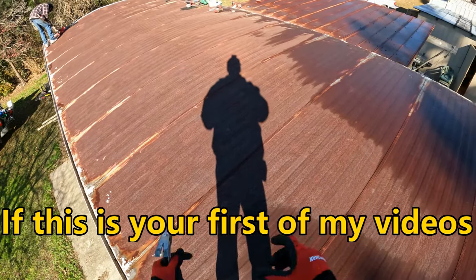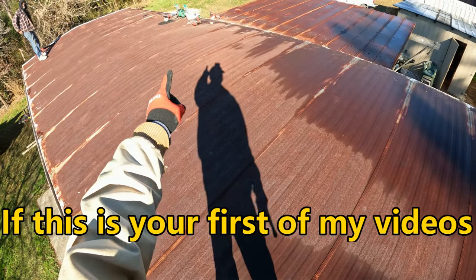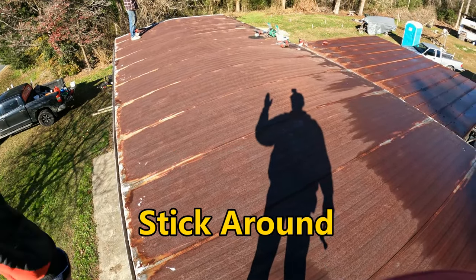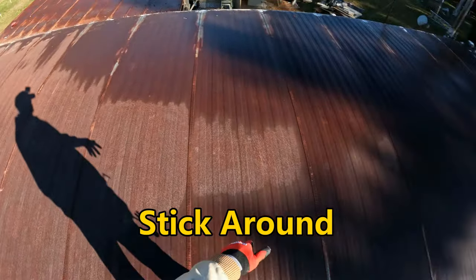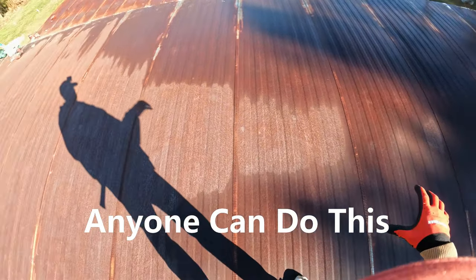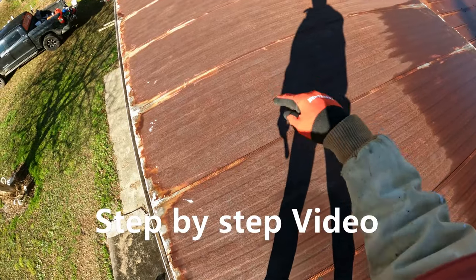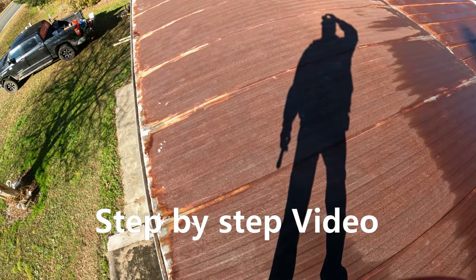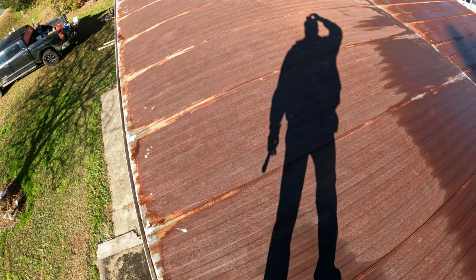We're gonna run slats, 1x2s, all the way down through here, rows and rows and rows, every 2 foot. What's that, about 8 runs across here, all the way down on this one. We're gonna attach our OSB to the top of that. So the slats will be attached all to the rafters. OSB on that. This thing's gonna be beautiful.